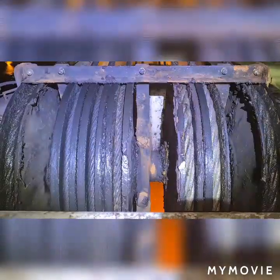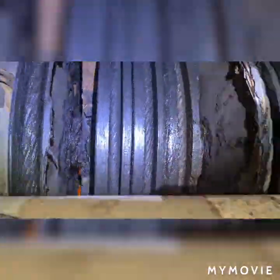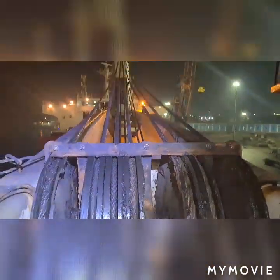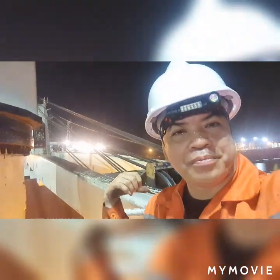This component needs to be checked. There's a grease point here — that's where we grease it for the pulley bearing. The grease goes in there. We are here on top of the boom rest of the crane jib. That is the grease nipple. We greased it so that the bad sound from the pulley is eliminated. After greasing, the outer pulley is rotated — that is the hoisting up and down jib out. This is the grease collection point.